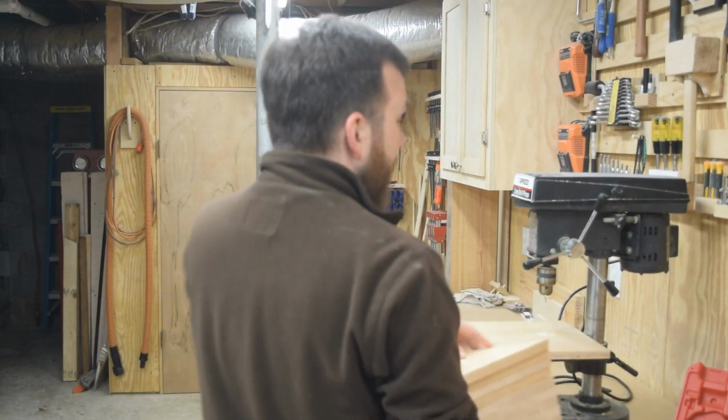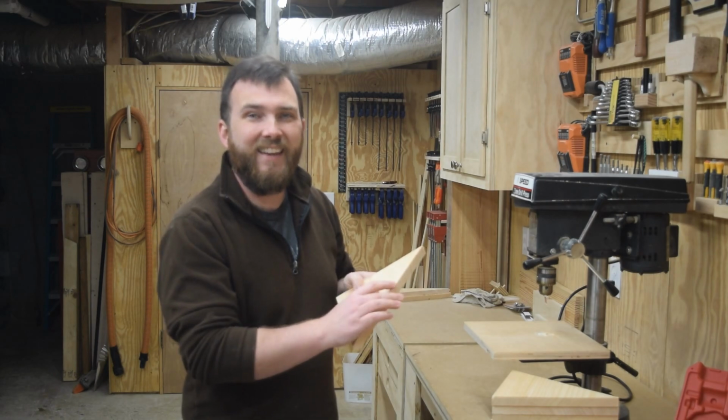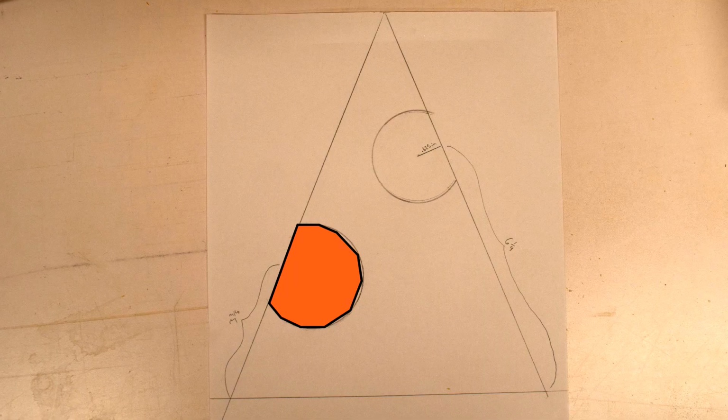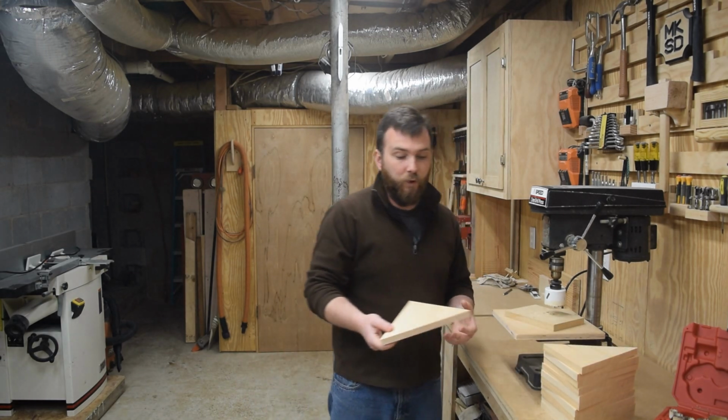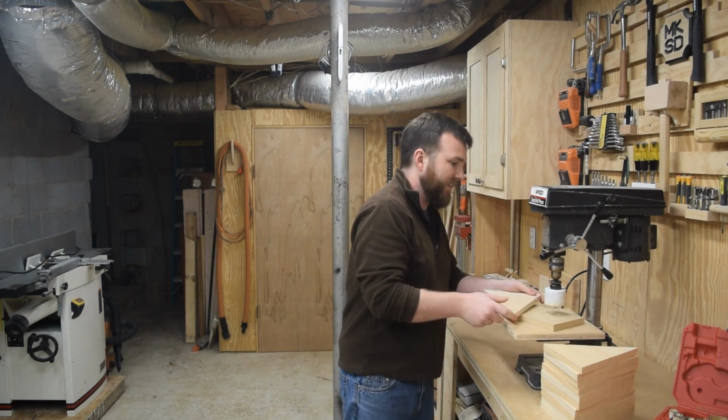The next step of shaping happens at the drill press, using a couple of hole saws to make cutouts in the edges. I'm using my 2 biggest hole saws for this project, putting the larger down low on one edge and the slightly smaller higher up on the opposite side. I've got center marked for the holes on all the triangles, as well as a small divot to guide the drill bit, so we're ready to get started.